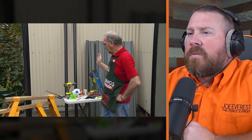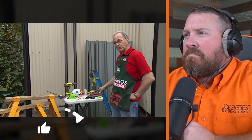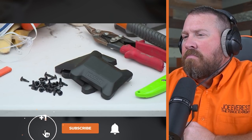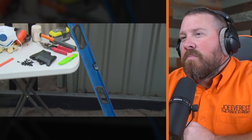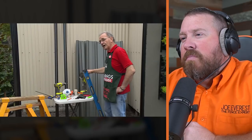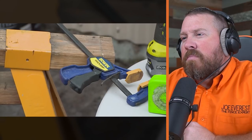The video will show how to install the infill panels for a Colorbond fence. Materials needed include sawhorses, a drill driver to fix the bottom rail, capping to go on top of the fence, a tape and pencil to measure the panel, a level to check it, an angle grinder to cut a panel if needed, a mallet, tin snips, clamps, safety gear, and the insert panels with top and bottom rails to complete the job.